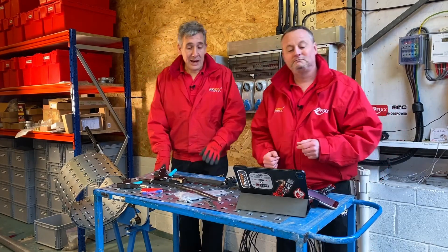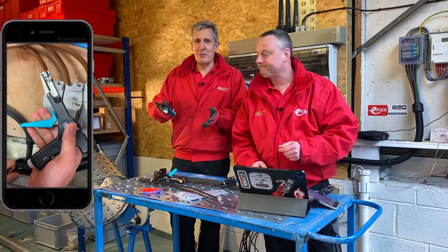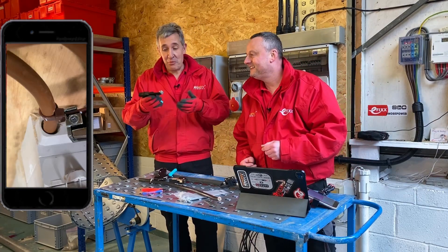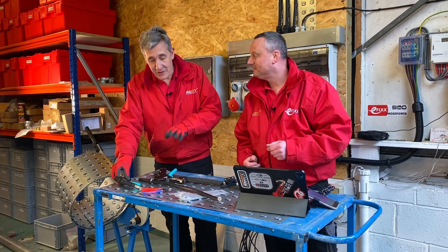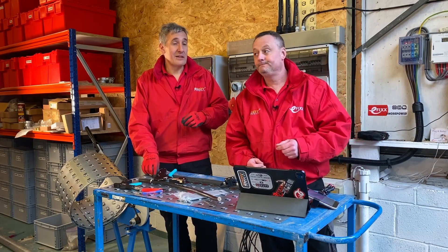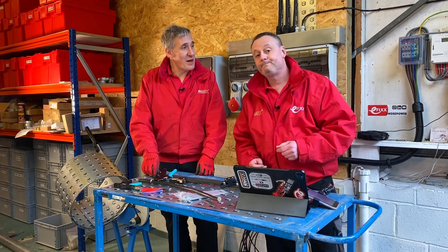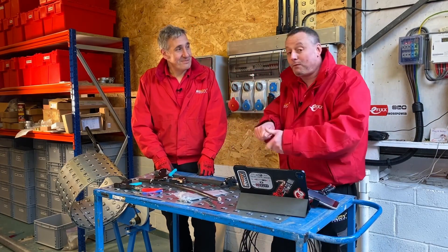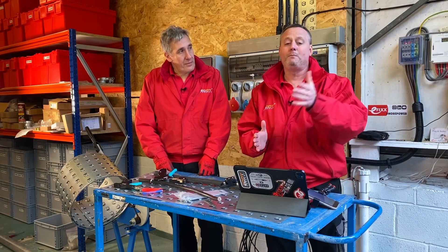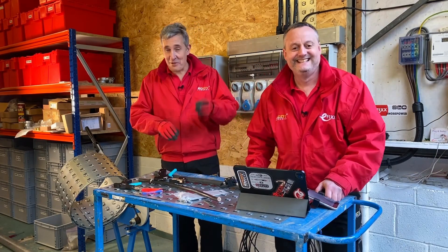Ross had a tool in there but we think we've found a better one to show you today. It's closely related to one we've featured on the channel before - the same kind of tool that cuts and tensions plastic cable ties. We think this one for steel ties is especially useful for electricians because steel ties are a little bit more tricky to tension and cut, and you do want a flush cut at the end. Otherwise you end up creating what is essentially a razor blade. Electricians try to pull it through with pliers, give it a squeeze, cut it off, and that end left behind is incredibly sharp and not as tight to the cable tray or basket as it should be.